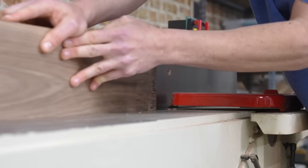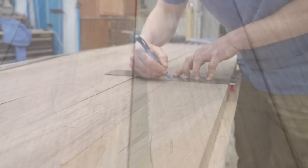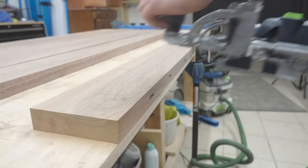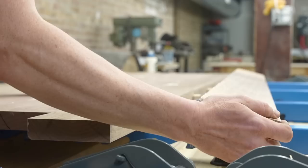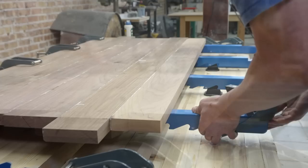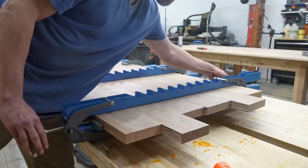Now milling the walnut is pretty much the same process you saw Cam doing, except I need to do it carefully and remove as little material as possible because I went with six-quarter material to save money — the eight-quarter walnut was significantly more expensive. I used dominoes to ensure the glue-up came out pretty flat, along with these deluxe panel clamps from channel sponsor Rockler Woodworking, which apply pressure from the sides and the top. The combination of dominoes and panel clamps worked really well for getting a flat panel that just required a little bit of sanding.